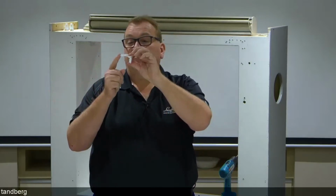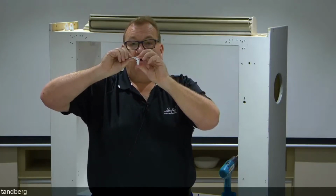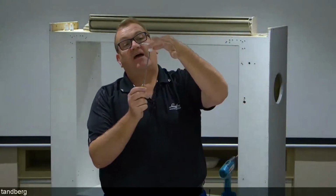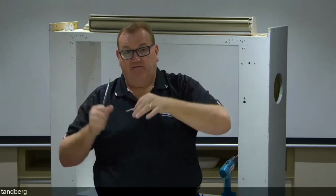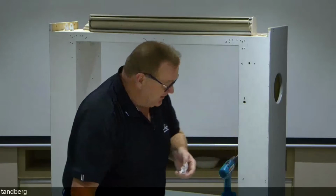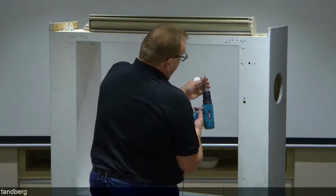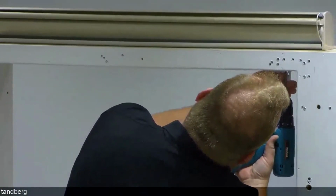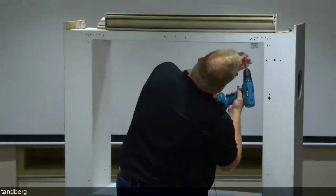Obviously, the head rail is going to come along and sit along that front lip and push up into the bracket. To release the shade from this bracket, you'd actually need to get, and I should have had the screwdriver here, but I forgot, you'd need to come up behind the shade and push up a little lever behind and then pull the shade off from the front. What I'll quickly do is just pop this bracket in position. I'm just going to put this other screw in the bracket, 2 screws per bracket, absolutely recommended.